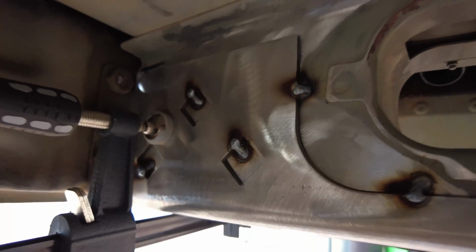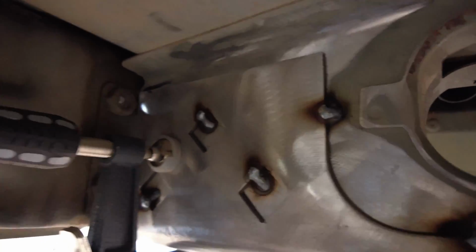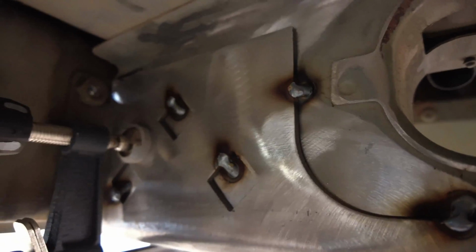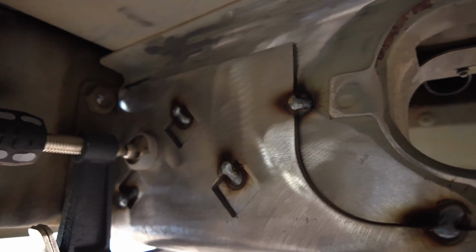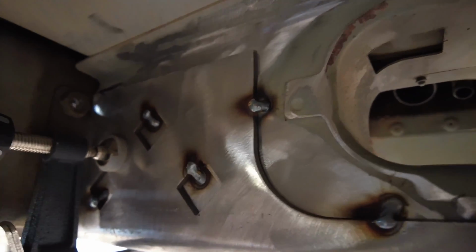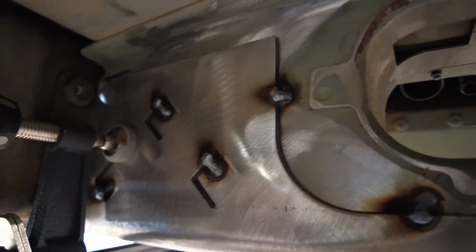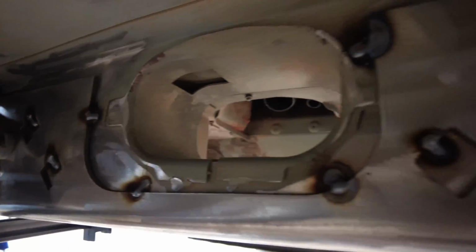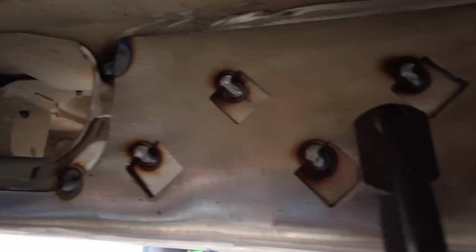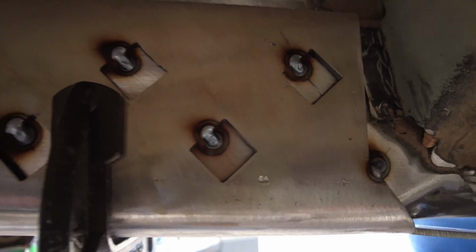Alright, I'll apologize now for all the welder fan noise in the background. I know it's loud, but cleaning both sides of the stiffener and then hitting both sides with acetone and the body is a world of difference. No, not as much popping, or not really any popping. No, just random melting. I mean, it took me maybe 2 minutes to tack weld all these.